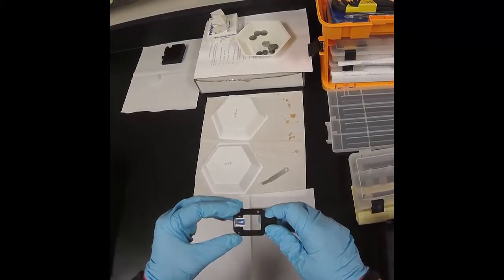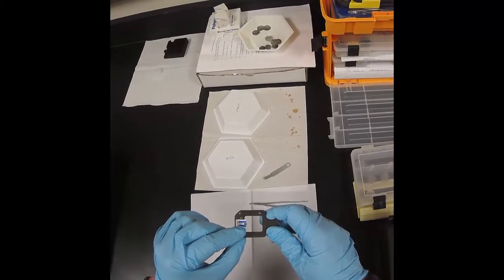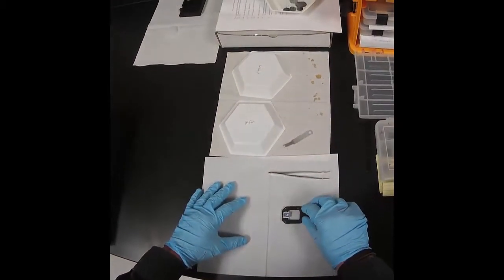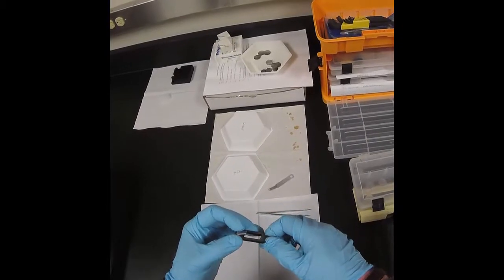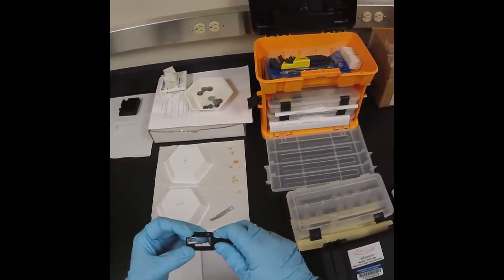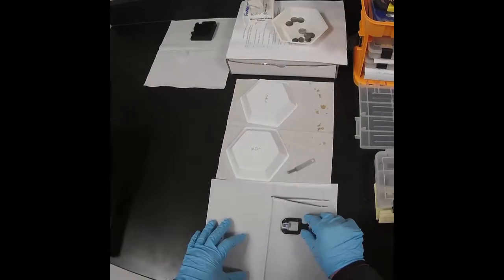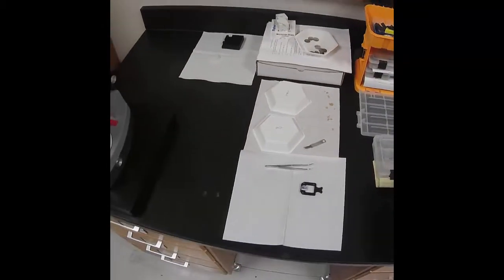The pre-mounted tapping probe is on this plastic wafer with the blue plastic strips. Let's go ahead and put a new tip in. The tips are worth about $30, and this is probably the only part you can realistically break. It's not the end of the world if you make a mistake — it's only $30. However, I don't want to have to replace it every time a student uses the instrument.